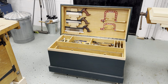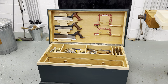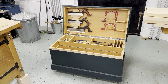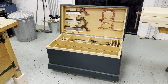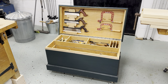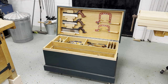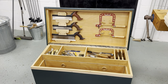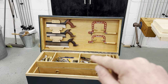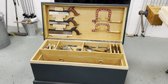The skirt at the bottom and the dust seal around the lid — you can alter the sizes and the bevel to whatever you like, and you can make them of softwood or hardwood, whatever you want, as it's going to be painted. This project is quite forgiving in a lot of ways. Even if you cut the lid off by hand and the edges aren't exactly aligned, the piano hinge raises the back slightly anyway, and the three-sided dust seal at the top hides everything.